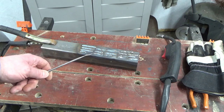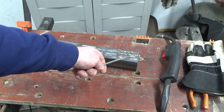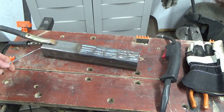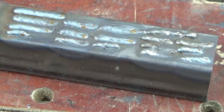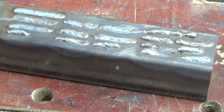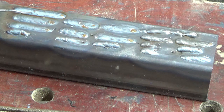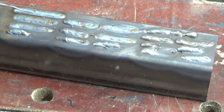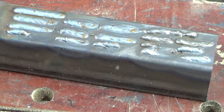I've been playing with the welder and the good news is it works. I've been progressively playing around with the settings on a bit of 50x50 box section, 2 to 2.5mm wall thickness. The welds at one end are pretty poor, but gradually working through the settings I got to my final weld, which is the best looking weld I've ever done — pretty consistent, good penetration. That was at full power, 130 amps, and about 3 litres a minute gas flow.